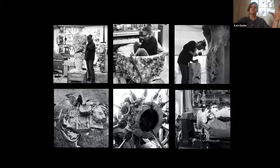If you're turning things green, you turn a tenon on the end, you hold it in the chuck. And if it's 60 centimeters long and still full of water, there's a real possibility that the front end is going to start dropping a millimeter off. And then when you're spinning it, mayhem. So this holds it. It tries to hold it in place. I mean, it's still a bit bumpy, but it does.